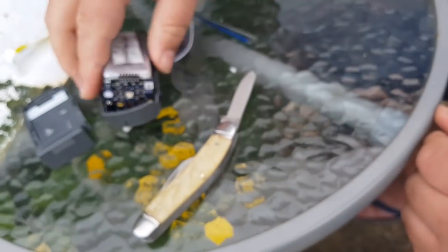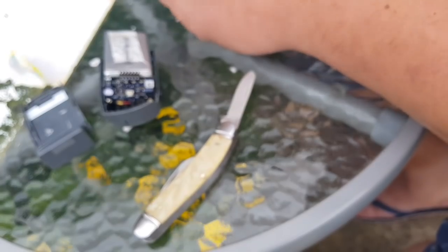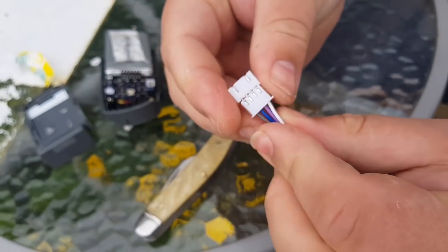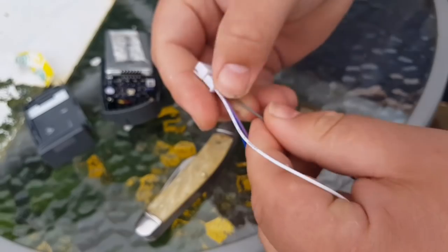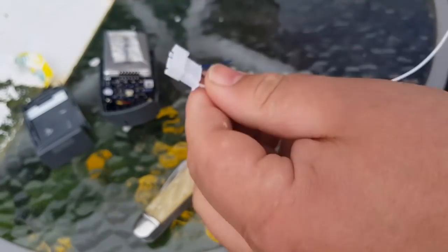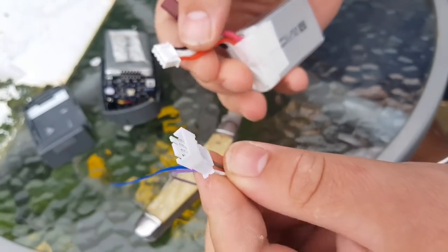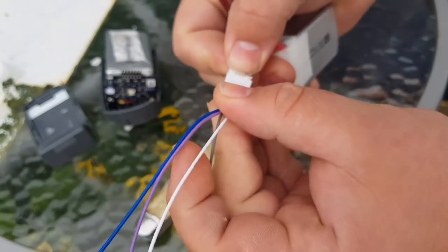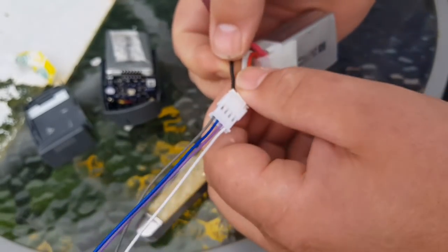What I use is just a JST connector with a female adapter on it. So when that's plugged in like that, your white one would be positive on this occasion and you use your grey one for your negative. You ignore the middle two — you can cut them off if you're doing it this way, and just have your two. On your external battery, your red is your positive and your black is your negative. When that plugs in to your JST: white positive to red positive and grey negative to black negative.